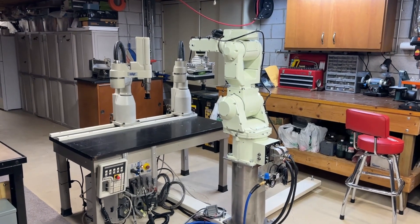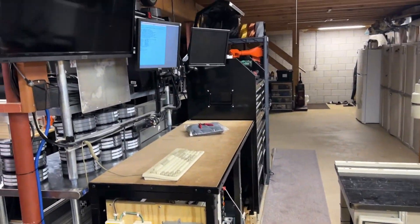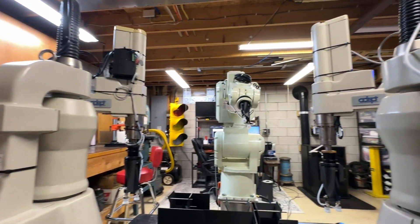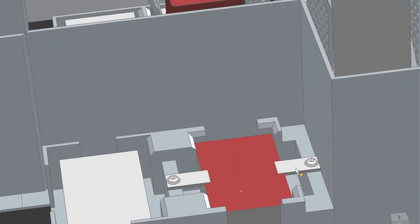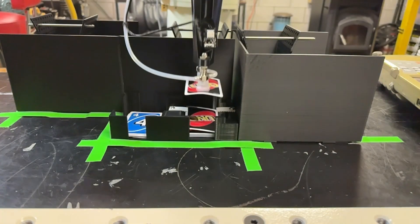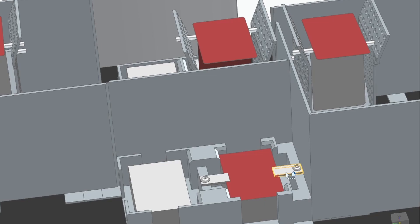At first I thought it was going to be easy — have a camera that recognizes the color and number of a card and then just match the color or number — but I soon figured out it was going to be much more complicated. The whole process starts with the draw pile, designed with white tabs made out of HTT2 belting that are flexible yet rigid enough to knock cards off each other to singulate them. It's really important the robot only picks up one card at a time.